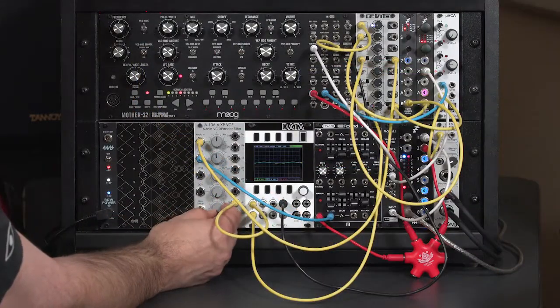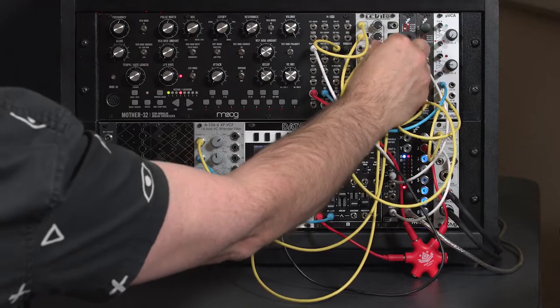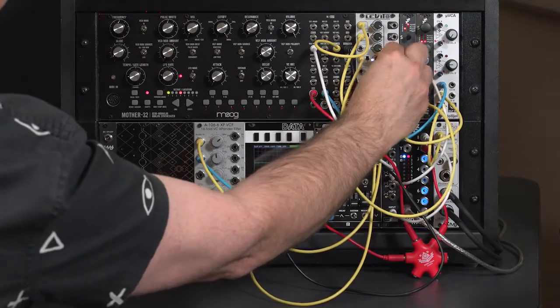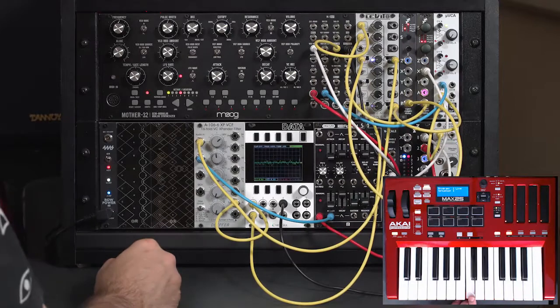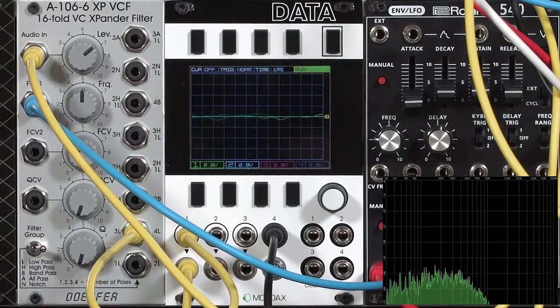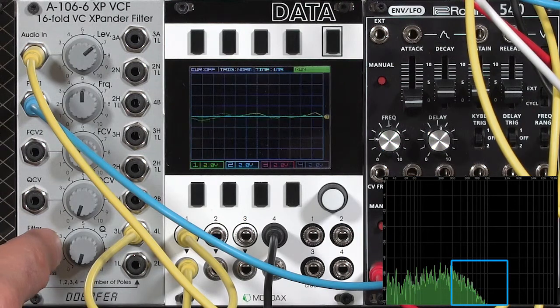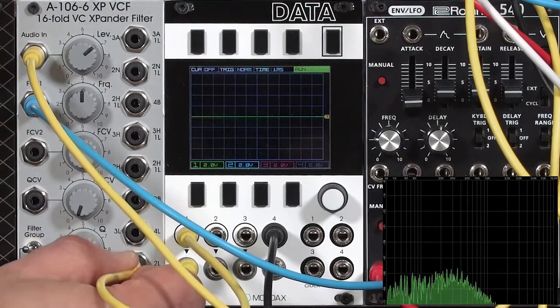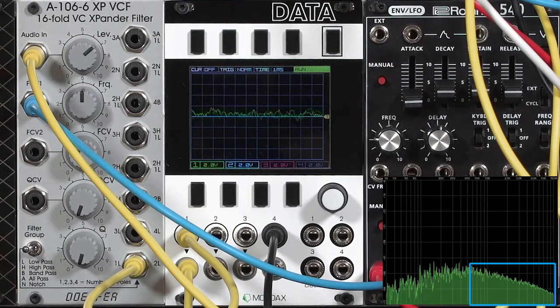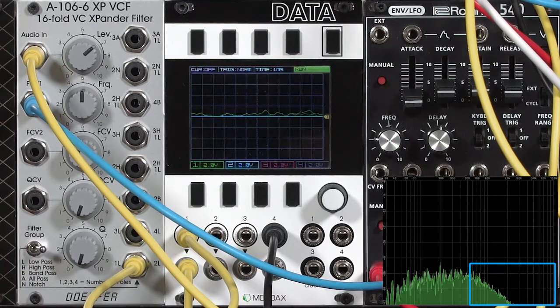To reinforce exactly what's happening with harmonics, let's briefly look at noise through this filter. Turning the noise level up, you can see the roll-off in the high frequencies for the four-pole filter. Here's the three-pole — you see that curve move to the right as more harmonics get through. Then the one-pole, which is very bright; it extends all the way off the right end of the chart, which is at 10,000 Hz.